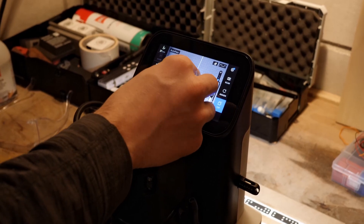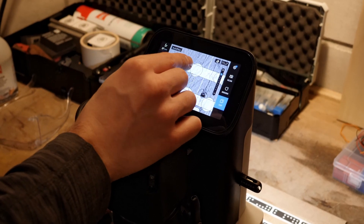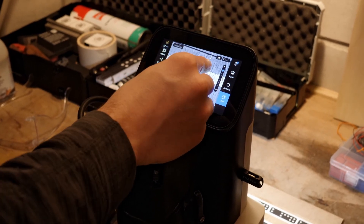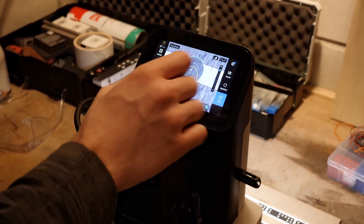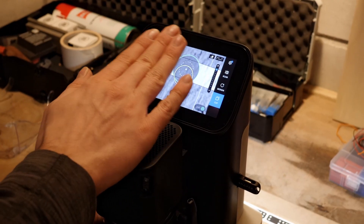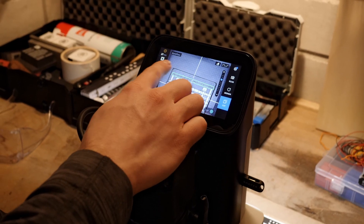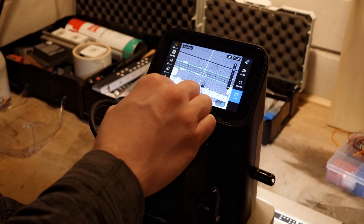Our workspace is set up and I'm going to start with the critical part - determining how deep we need to cut until we reach the repair care without cutting too much of it away. With these circular pockets, I'm going to start with a cut depth of 20-21 millimeters and then edge my way forward until the whole pocket is basically filled with repair care that we applied from the other side. Afterwards I'm going to cut these long channels for the LED stripes and hopefully they're going to fit in there pretty well.